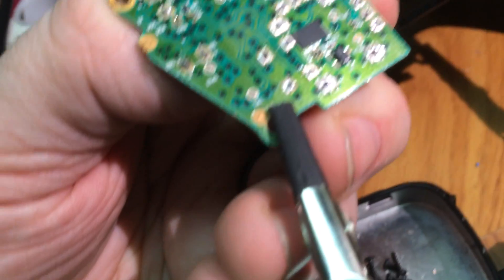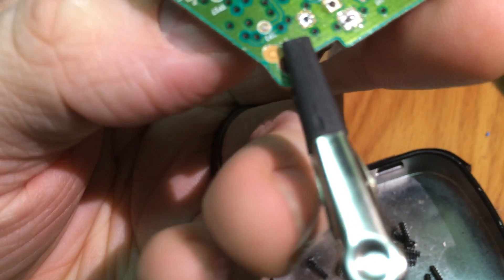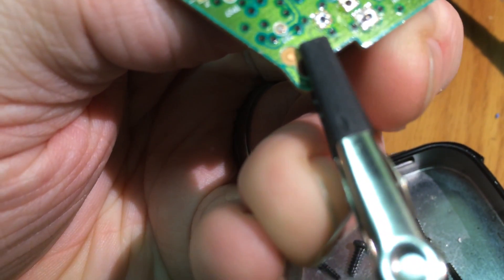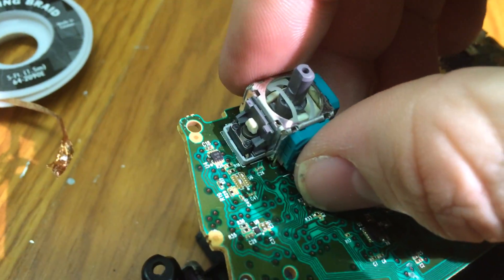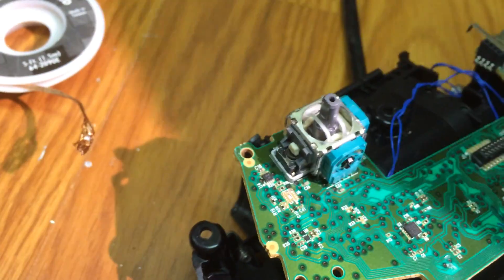This is one I've actually just been desoldering and it's on its way out. There are a couple of solder points being a little stubborn that I'm working on. As you can see on the other side here, I've kind of already got it started — so it's just a matter of getting these last couple of solder points out and then this stick will come off.